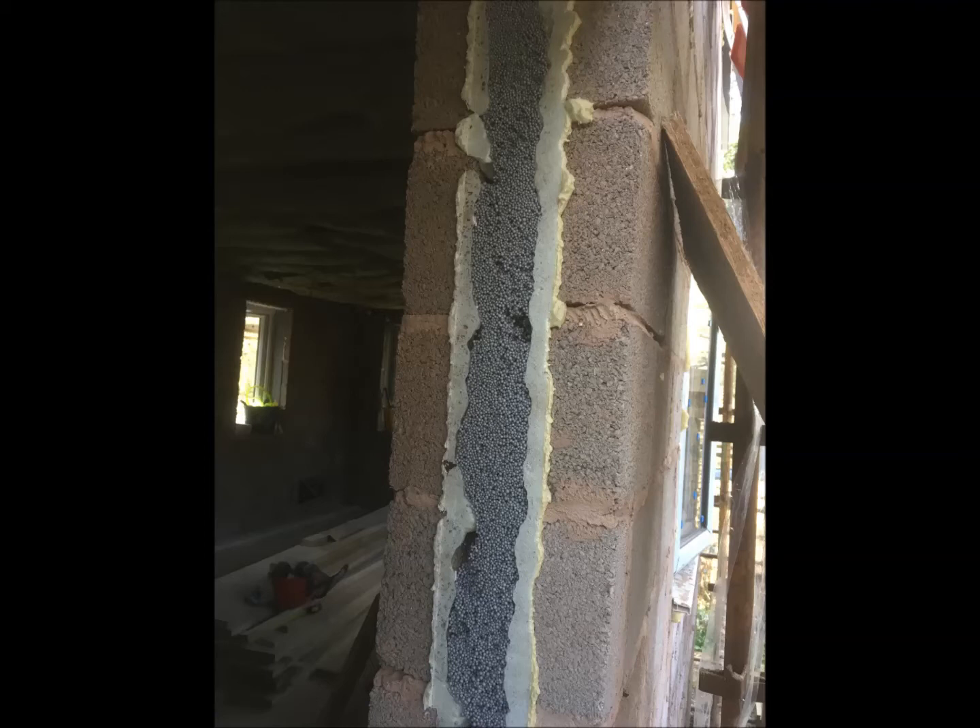As you can see the fill is quite good. There are a few little pockets here and there, but I'm not too worried about that — most of them just trap more air, so it's still insulation. You can see that the beads fit in tight against anything you might have there. For instance, where we used cavity closers — plastic sheets which fill up the cavity — it's nice to know that the beads will be snug up behind those, making good insulation there.